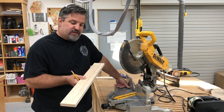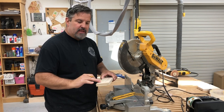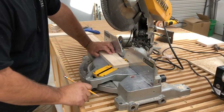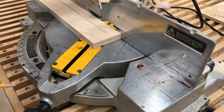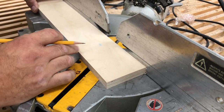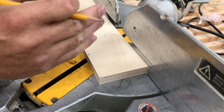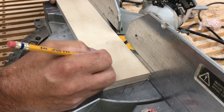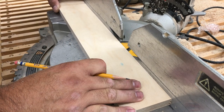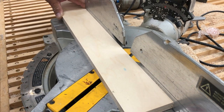Now we have our boards over at the miter saw and we need to cut them up into triangles. There's enough material here to make 22 equilateral triangles if you cut them right. First we're going to set our saw on a 30 degree miter — there won't be any bevel so it's on zero. We're going to cut our first cut and just flop the board over, and when the blade comes down you want a nice point on your triangle. Put a little mark on your saw and just keep flopping that board back and forth cutting on that mark. These are just rough cuts so they don't have to be super accurate, but you do want them all pretty close to the same size.